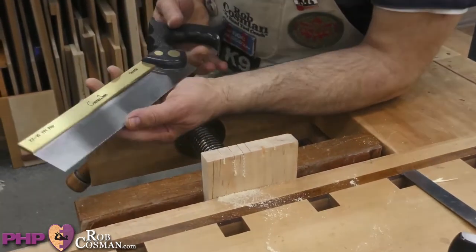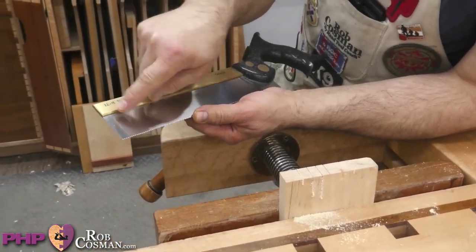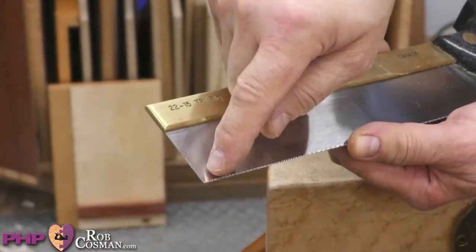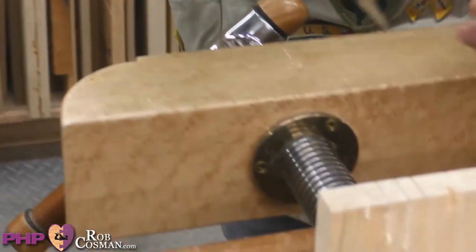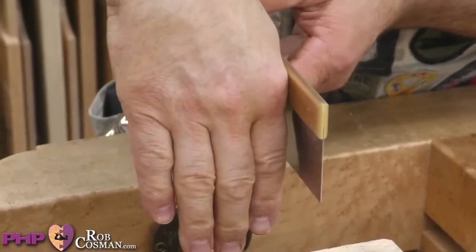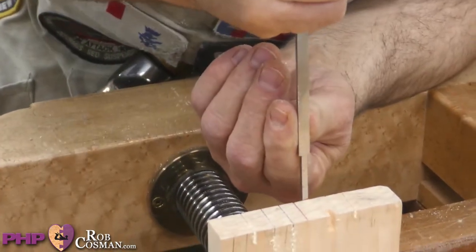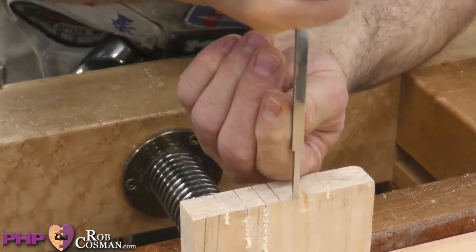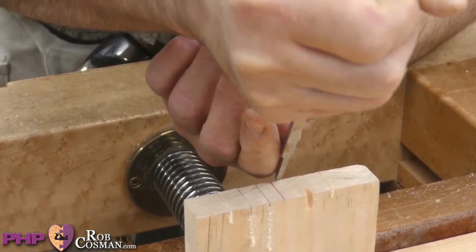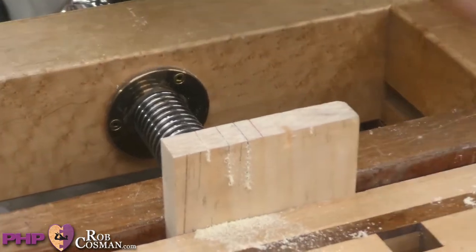So what I decided to do was to dedicate the first 2 inches of my blade to 22 teeth per inch instead of 15. Then I took the cutting face and I relaxed it. If you have a 0 degree cutting face, imagine you are about to try to push that straight through that wood. You can imagine the amount of resistance you get. But if you angle your tooth off a little bit, then it almost slides over the top and it'll leave a little score on there, but it certainly doesn't dig in aggressively.